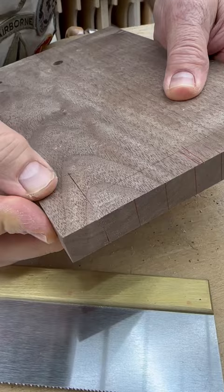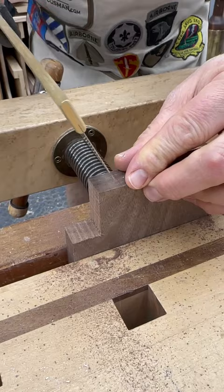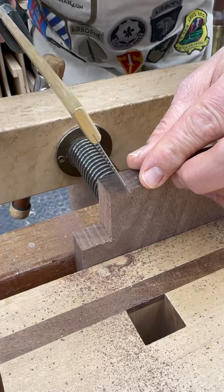Now, if the saw works, you've got to learn how to work the saw. And starting it with accuracy is the most important. Here's what you want to do: pinch the wood with your index finger and thumb. Pinch it low enough on your finger so that the bump created by the thumb and finger are above the set of the teeth.